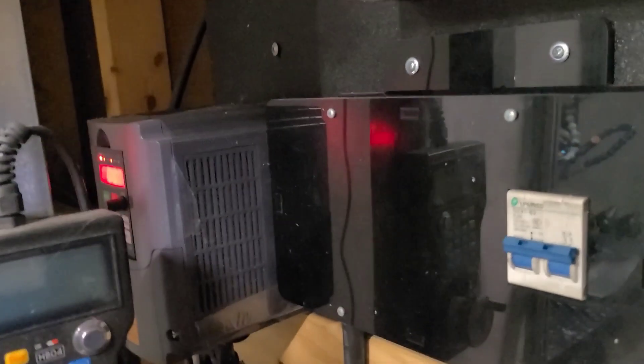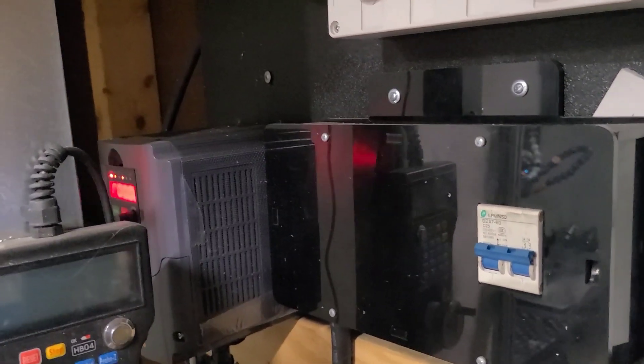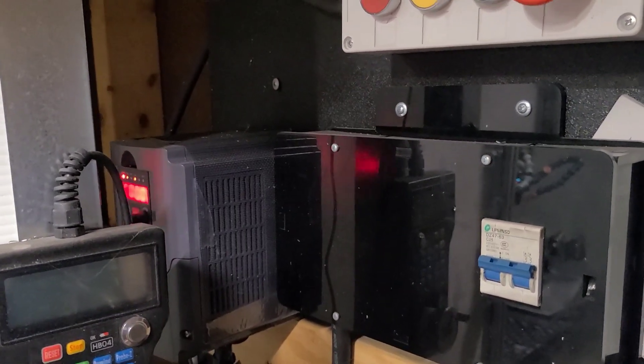You've got a VFD that requires a 220-volt single-phase, 20-amp circuit. The rest of the mill — the control, the computer, everything else — is just standard 110-volt power.